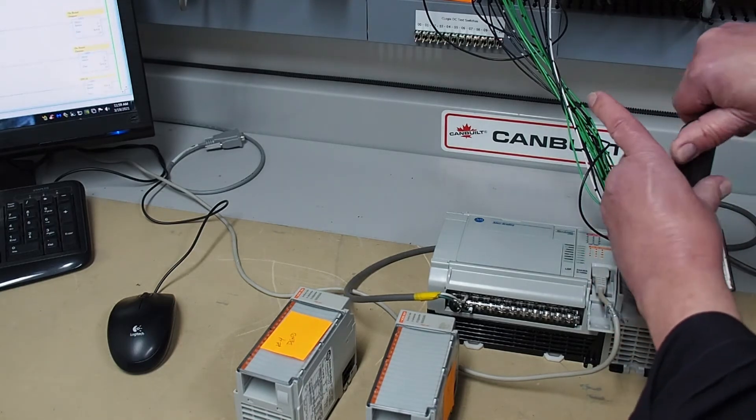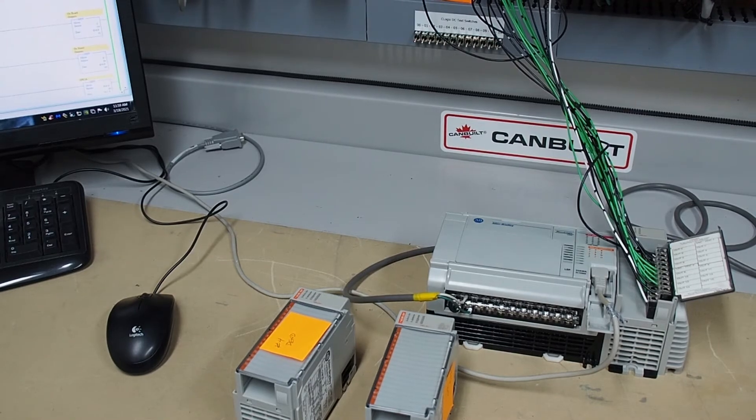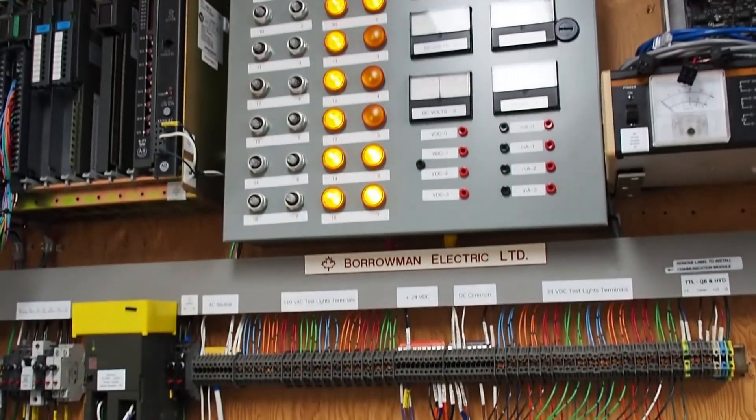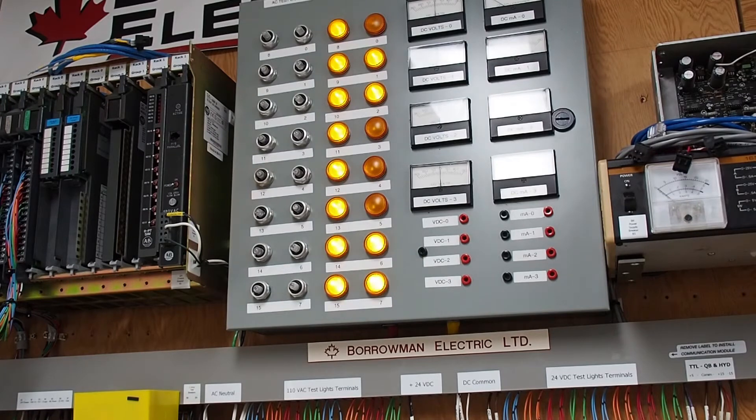It's always good practice to screw it down. So there we are — it's all ready and flashing away. Looking up at the board, we have four different relays dead: zero, three, four, and five are all dead. But they're working on the lights at the output — the relays are trying to work but they're obviously burnt out. They've seen a heavy load at some point. That one needs some work.